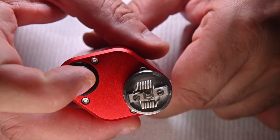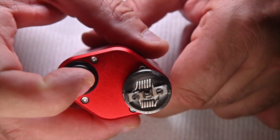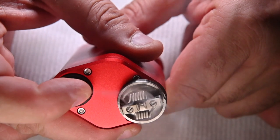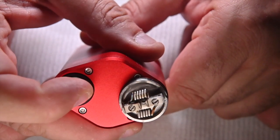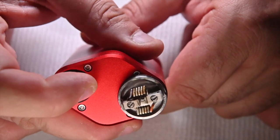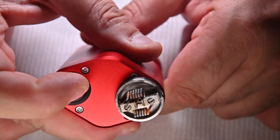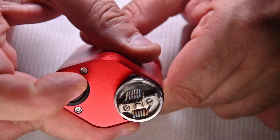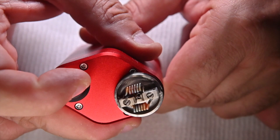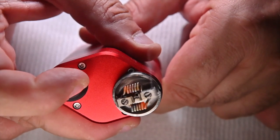Now the coils I have wrapped here, this is 24 gauge Nichrome 80 wrapped in 36 gauge Nichrome 80. All twisted messes wire. I do a slow pulsing because I got two hot spots always at the first lead on either side. Slowly pulsing though.